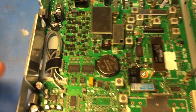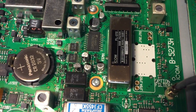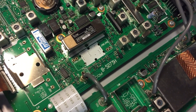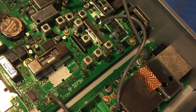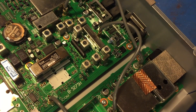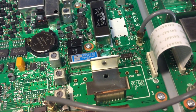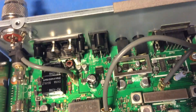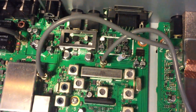This thing has the optional DSP unit right there — there's the board. It has a single sideband filter in it, which I would expect something of this magnitude to have. It doesn't have the CW filter, which is no surprise, and it does not appear to have the high stability reference oscillator. There's no voice synthesizer either, which is fine. There's your filter network, some other relays and stuff. I think it does full break-in and all that.